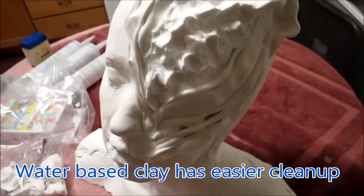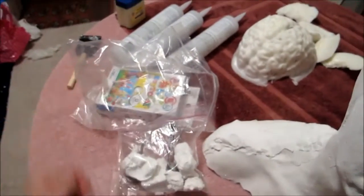First, a water-based clay is used to do the initial sculpt, as you can see here. I just used really, really cheap clay that I found around the house. This is literally clay I bought at a Japanese dollar store for $1.50. So at this time I was thinking to myself, well, I'll use a softer mold, silicone obviously being the ideal, but I can't cast latex into silicone. And then I happened to have some Flex Foam-iT, Smooth-On brand polyurethane flexible rubber, and I figured, bam, perfect. The stickiest thing on the planet, and the only thing on the planet that won't stick to anything. A perfect pair to go together, and then we'll experiment with gloving the final foam piece in latex, for ease of painting.